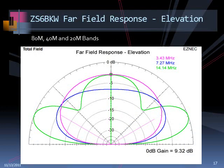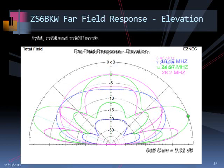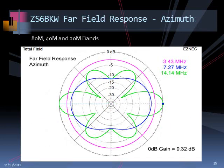The far-field responses at the three lowest bands show the first two are pretty much classic dipoles, and the 20-meter one starts to show more of the characteristics the G5RV had — a nice low angle takeoff, a little higher center hump but still not too bad. The higher bands have a little bit lower gain. The gain looks higher on some — about 9.32 dBi on one — and you still get fairly nice low takeoff angles, so it should be pretty good for DX on most of the bands.